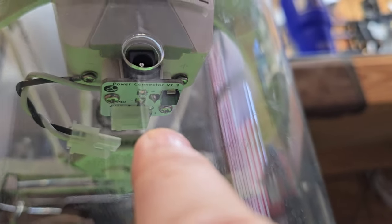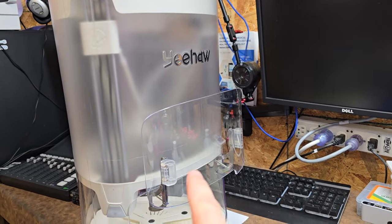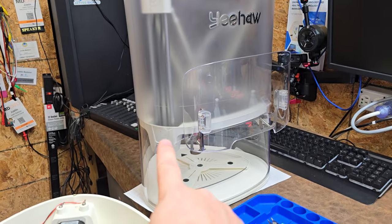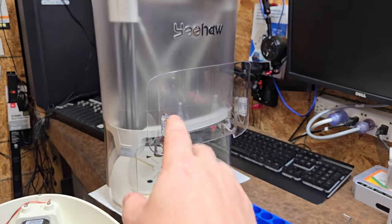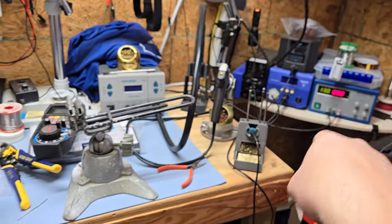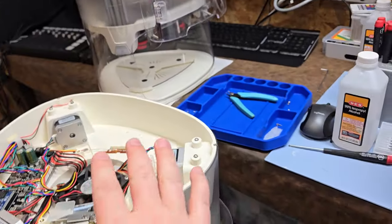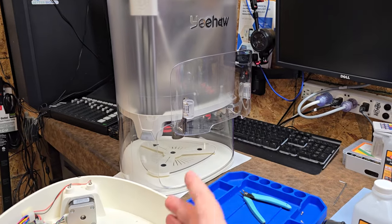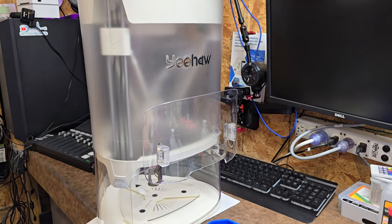Something's going on with this little chip. The amazing thing is the other printer was doing the exact same thing and I never ran that one higher than 12 volts. That little board, that little chip — something on there is either defective or purposely defective, because if it runs at maximum current it's going to blow up the external DC power supply that came with the unit, or put it into over-current protection mode so it never boots up. Either way, that little board could possibly be designed to be that way.